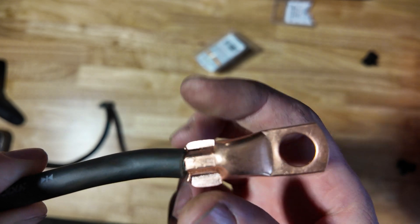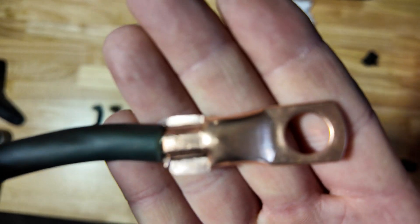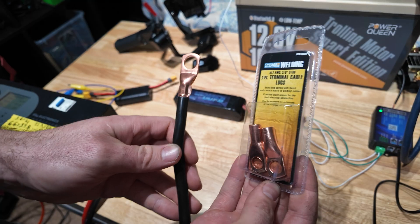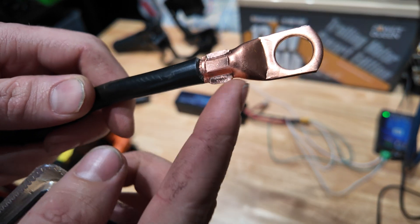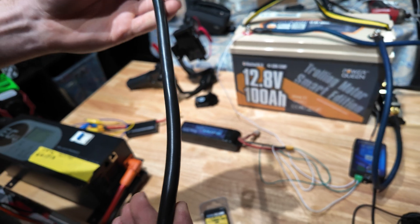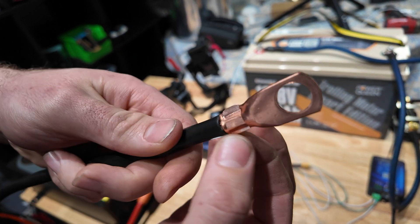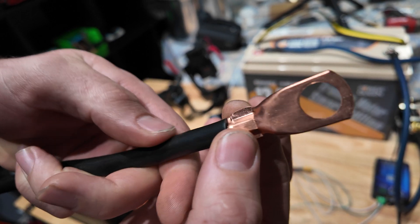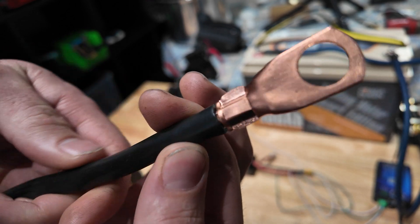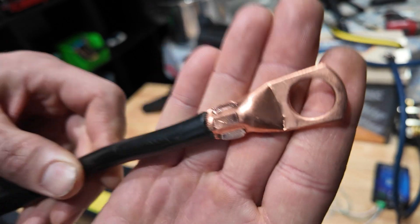My crimper leaves little wings on it. If you want, you can re-crimp it in the other direction to push those in, but I normally just leave them. You can see we have a very nice, very tight crimp — pull on it and it doesn't want to come off. The reason for the wings is that the only dies available to me are for number two gauge wire, and we're using number four gauge wire. So the empty void is at the edges, but all the wire is squished and nicely crimped in the middle. When these fuse together in the crimp, it actually makes it a little bit stronger. It is a very solid and reliable connection.